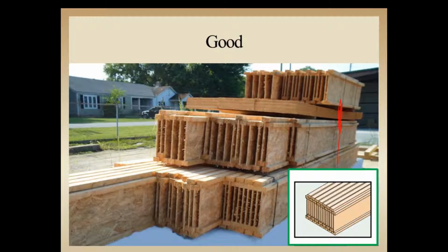And if you looked up front here, you could see that there's no stickers on the unit that's below and between the I-joist here. So we would want to have some sort of stickers here for the same reason we have on the ground, that we reduce moisture potential, absorption into the I-joist flanges, and just for damage when the fork driver comes and moves the material to a new location, that we don't risk damage to the flanges by having clearance there for the forks.